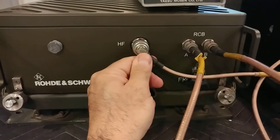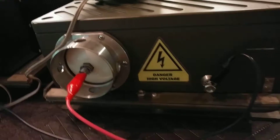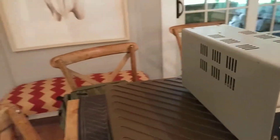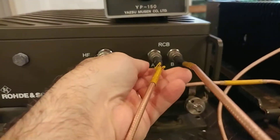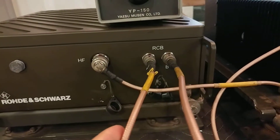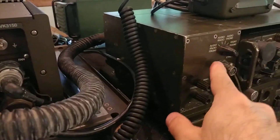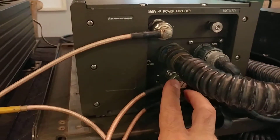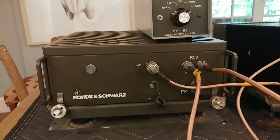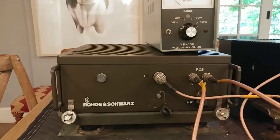Here's the HF input on the ATU. That is the HF output — high voltage system. I'm using a simple alligator-to-BNC for my power meter, though I suspect it's not very accurate. The very interesting thing is the Radio Control Bus, which is a Manchester-encoded serial bus that appears to operate in a ring fashion — one in and one out. From the radio itself, that control bus comes over a pair of coax pins and then exits using standard BNC coax. There's no dedicated power or multi-conductor control cable.